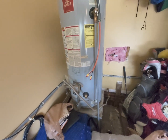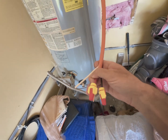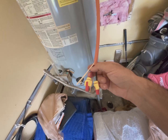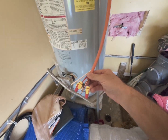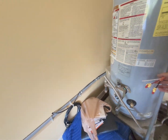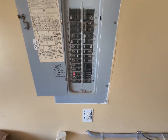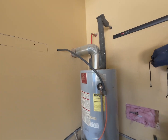I did check the voltage and everything's good to go. Typically you're not going to have this white wire for a water heater — usually you'll use 10-2 and tape the white one black and use it as a hot. But this is just what I had on the truck; I left the 10-2 at home. So basically you just cap this off or cut it off if it's not needed, and it's capped off in the panel as well. The voltage is good, I got the breakers that I moved relabeled, so we are good to go — ready for a new electric water heater.